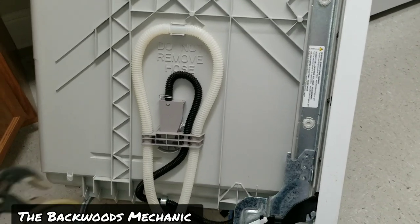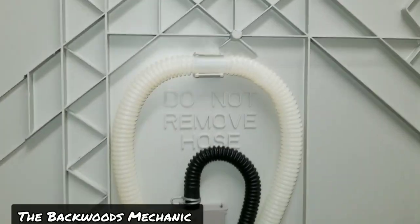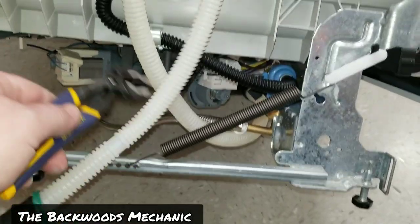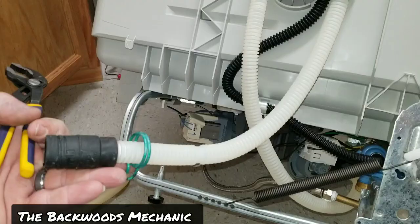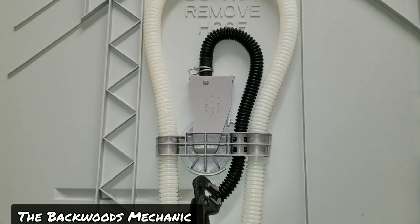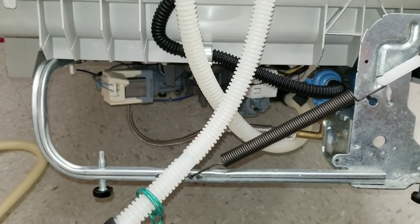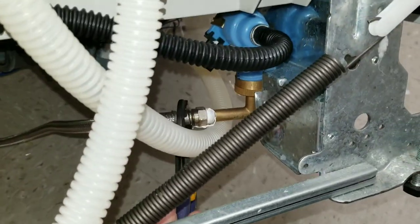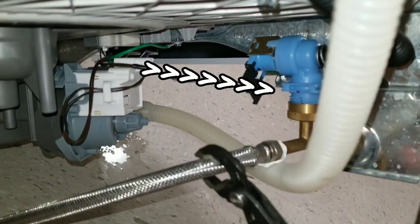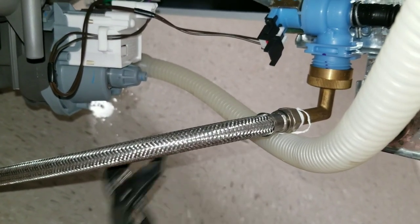With the dishwasher, as soon as you unbox it, everything should be ready to rock and roll straight out of the box with the exception of very few things. You'll see it says 'do not remove hose' — they basically mean don't remove this hose right here. This hose needs to stay attached down through here, but you can pull it out through your cabinets and fish it through to hook up to your PVC under the sink. Usually if you do it just right, you can leave it hooked up top, put your hole through the top, and run it over to the adapter that goes underneath the sink. You can also take it apart by turning the nut counterclockwise, or go get another hose to adapt to it. First things first, you need a supply line — the water coming through the wall into the dishwasher area. It's going to be a nice long hose that you plug in right down here on the dishwasher.